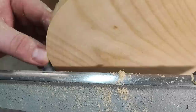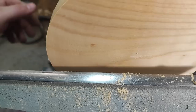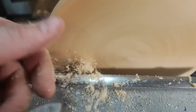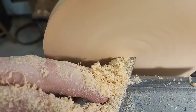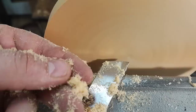There's a little bit more torn-out area here so I can go one more pass. Again, here at the center the wood is not spinning as fast, so you just have to adjust your weight. And now you can see really powdery stuff — this is flat.